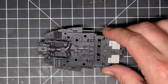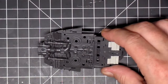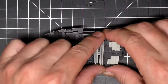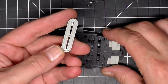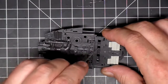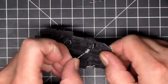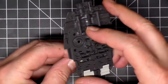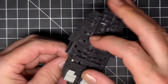I also did the same thing in these 4 spots here. There's some peg holes that were on the bottom of this that made this fit down in there. So I took the pegs off of here, cut the backs off so I had the slits open, and then I have these 4 holes in the back here, which work out great because they hold the LED, so I can glue the LED that way, and then it's pretty much a flush mount on the inside.